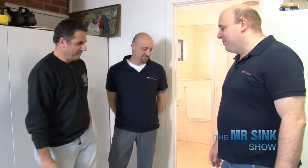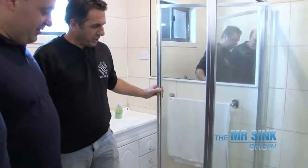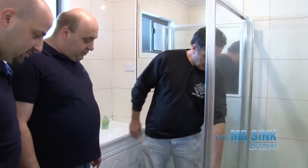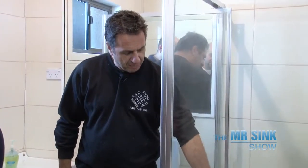How are you doing? Good. Can you help us with the shower? I sure can — that's what I do for a living. Let's go have a look. This looks like a common problem that happens to a lot of showers after a few years of use. You've got some grime, soap scum in the corners, bit of mould, bit of grout missing around the drain — which is crucial to fix, because you get water leaking through, it gets underneath and starts lifting up tiles.